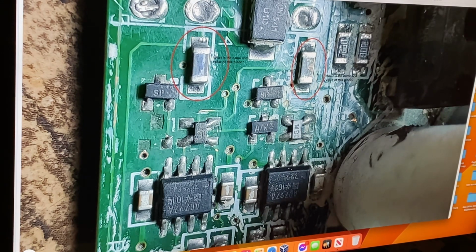This thing here, that is a BF908. It's a dual gate MOSFET, and that is used to supply bias current into the AD797 op amp, whilst the input FETs here are open circuited, so it has no bias back through the coil circuit, and that keeps these in a stable position, so that the input doesn't fly up or fly down. It has to stabilize when the receiver comes back on. It might cause noise in the receiver chain, but that's what it does.